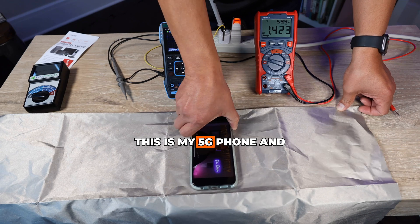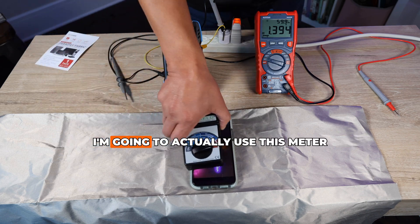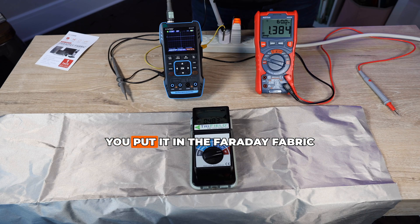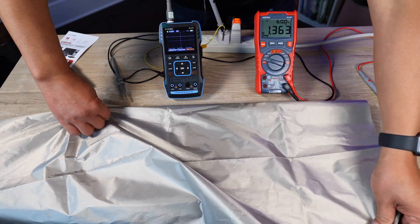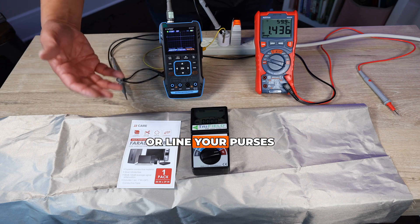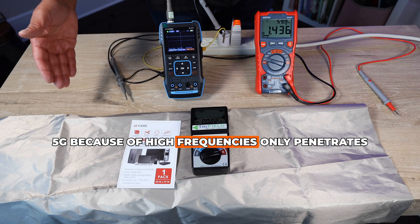If you connect this oscilloscope to the Faraday fabric, you can see it generates a sine wave at about 60 Hz. My 5G phone is running a YouTube video so the screen stays on. Using this meter on the RF setting, the phone is generating anywhere from a few hundred to almost a thousand millivolts per meter. When placed inside the Faraday fabric, the reading drops to basically almost zero — so Faraday fabric is actually good at blocking 5G. If you want this fabric, you can make purses or line bags to block 5G and Wi-Fi, though remember that 5G at high frequencies only penetrates the skin about one to two millimeters.